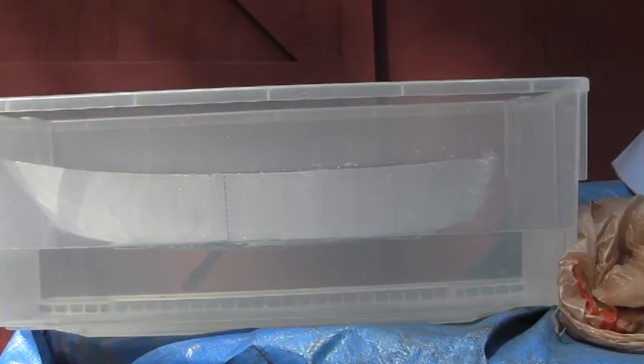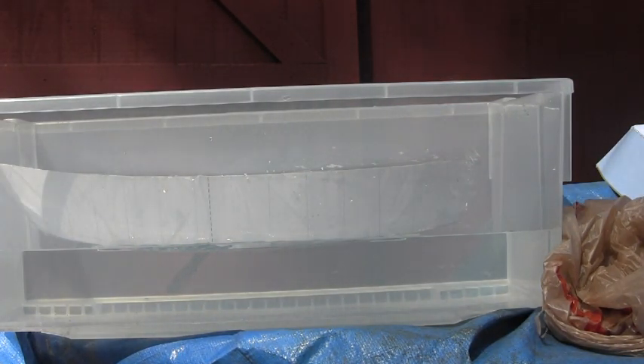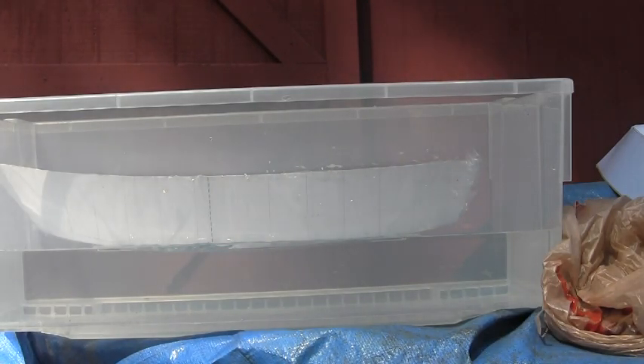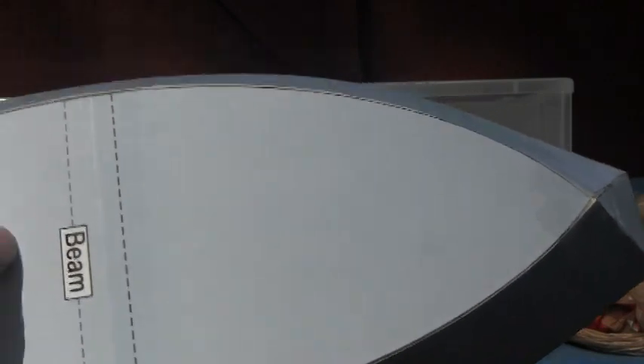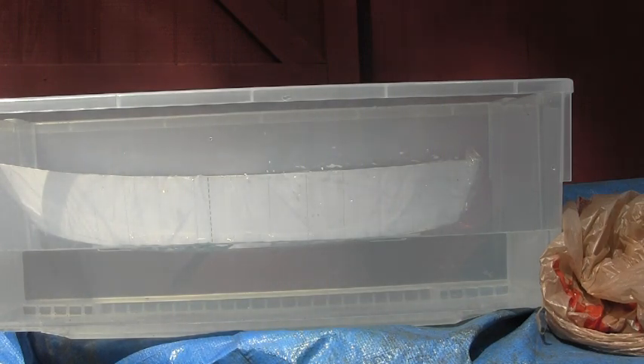It's in the tank, moving around, and it's just barely — it's got such a wide bottom. When I designed this one, it's about 14 feet, maybe 14 feet 3 inches, maybe even 14 and a half. I designed it so the bottom is no wider than a sheet of plywood, so it's got a 48-inch wide bottom — the beam line right here is the full width of the plywood. So you don't have to scarf fore and aft; it's just a scarf to join the two panels together, and there's enough left over on the bottom panel to cut out the transom and the bow panels.